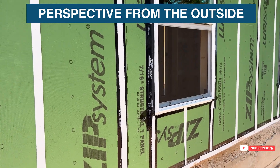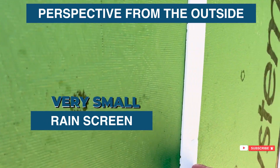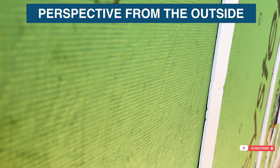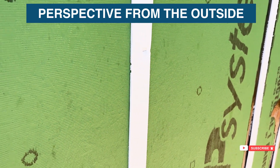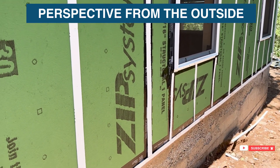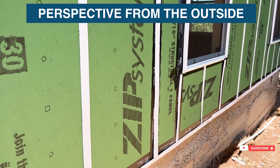While I'm outside, let me talk about the window install. Again, basic home, basic windows. In this case, we're using a very small rain screen — it's a corrugated plastic we buy in sheets and cut into strips, about an eighth-inch thick. To have all the benefits of a rain screen you really should go bigger, but on spec homes I go small because I'm making the job easier. We don't have to do anything special around the windows, don't have to buck them out, and the trim is easy. For a spec home, we need to control how long it takes and how easy it is, otherwise we're not competitive with pricing.